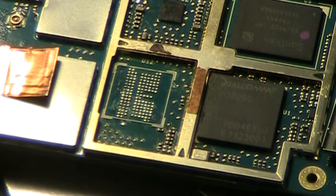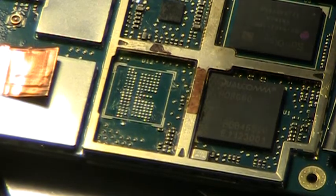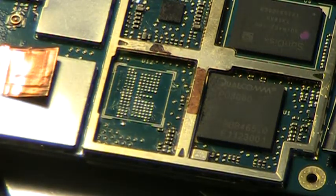I know you probably can't really see the detail, but I've cleaned the solder off the pads. I've used this knife very carefully and gently just to feel and make sure there's really no solder bumps — to go over and make sure the pads are smooth. I've used some alcohol wipes to get rid of the flux. I used solder wick, and I didn't film it because it takes forever. It was a few hours, so I took some breaks.